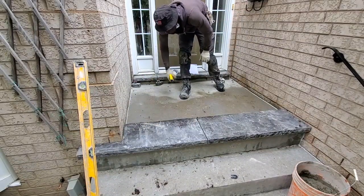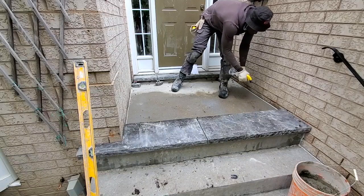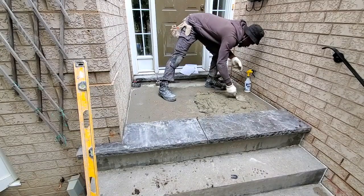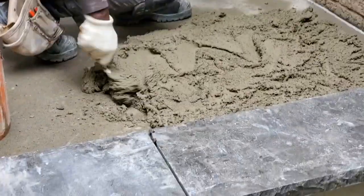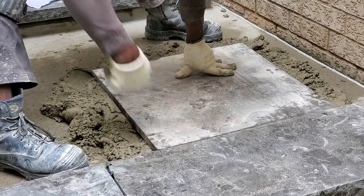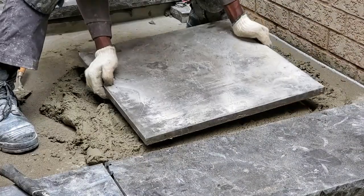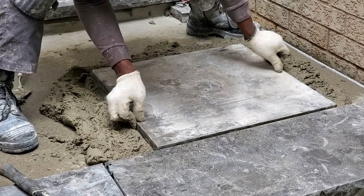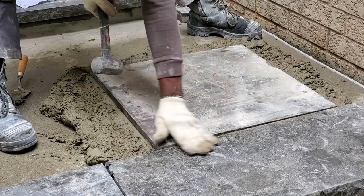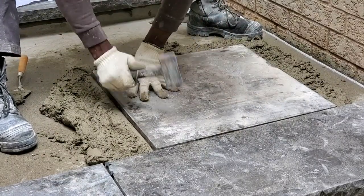Type S mixed with Mapei. The one that we just used is straight Mapei mortar. To install our coping, this one is gonna be mixed. Guys, you also want to wet your stone, the back of your stone. Right now, I already see the piece. I have a mark here. That's where we want to get him. So now it's higher. It's always better to bring it up higher and bang it down. That way you know that everything is intact.